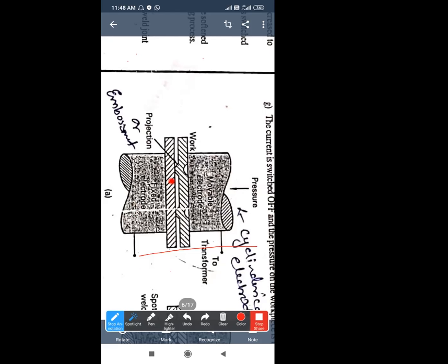At the end where they are stopped, due to the dashing of the electrons, coming into contact with the electrons or rubbing of the electrons, heat is generated. Because of that heat generation, the workpiece material starts to melt there. When the workpiece material starts to melt, both parts of the workpiece are melted. Projected means what? This particular area of the workpiece only should melt. That is, it has been highlighted or projected. How is it highlighted and projected? By doing embossment. When this particular area melts, both workpieces fuse with each other. Fused means what? Both the liquid metals mix with each other. Mixing of liquid metal is called fusion.